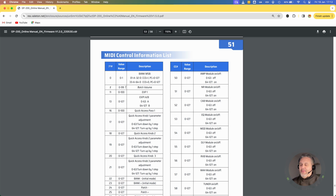Why? Because if you look at the description, you can see that it is supposed to send a command that controls the patch volume. The patch volume can vary between 0 and 100%. So from 0 to 99, very simply. That's why the values are switching in this area. And I think it's kind of obvious. If I send to our Valeton device a control change number 7 bearing a value of 20, I'm expecting that the patch volume is set to 20%. Of course, this is what I'm expecting and what is written in the instruction manual. Of course, we will have a look at some examples for this if you are so kind to follow me in this adventure.